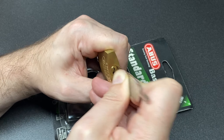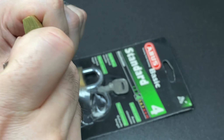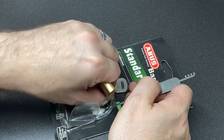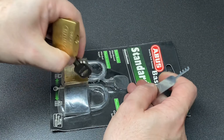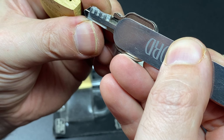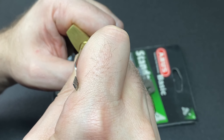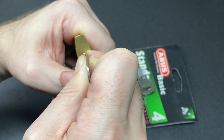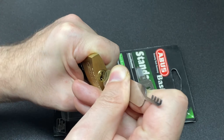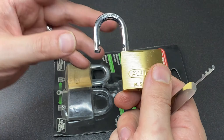Oh, that feels like it's almost there but not quite. Let's give that another go. Basically the way to measure it up is by looking at the key and seeing whether the spacing on the comb fits - and that looks like it might, so let's try it again. Hard to get around that warding, but I think we might have it - yeah, we got it! So it is actually the smaller side of this comb; it does work, it's a bit of a fiddle.